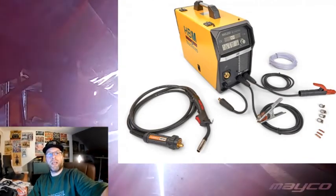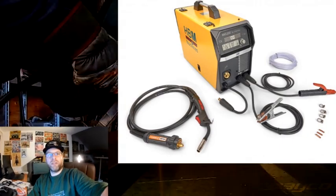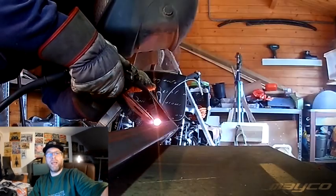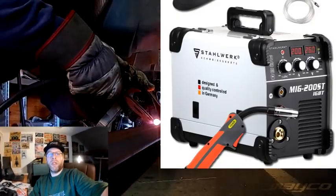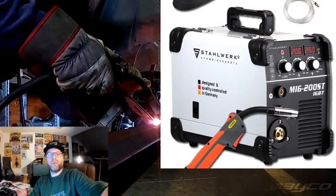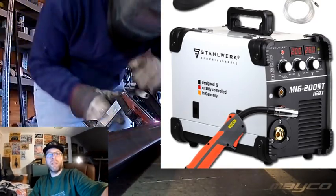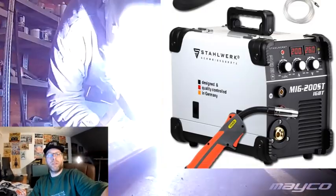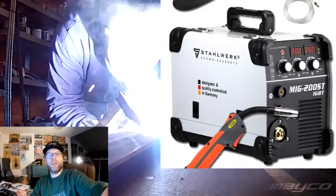The machines I've selected: one has Synergy, and the other has voltage and amperage adjustable — but when you adjust your amperage, it also sets your wire speed. Then it has a third control that you would think is wire speed, but it's actually to optimize between the two. Apparently it works very well.